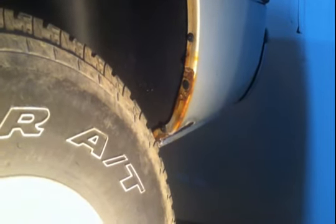I ground down the welds on the fender on the other side — the bottom fender patch that we made — and the square one we made for the other side. I have that kind of surface rust right there to grind off in a lot of places, like across the bottom — just really light surface rust. That one I need to do might need filler put on it. But I gotta do that hole down there too. So it's grind-and-weld time — get everything ready for the first coat of dura-glass.